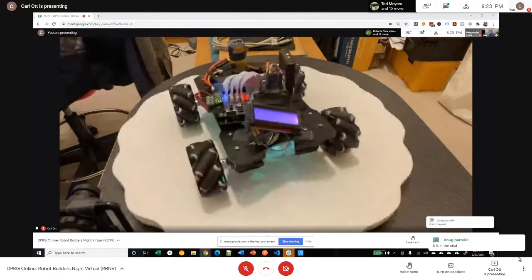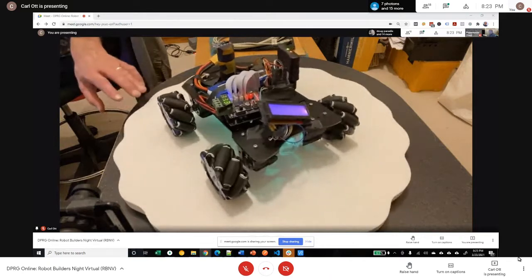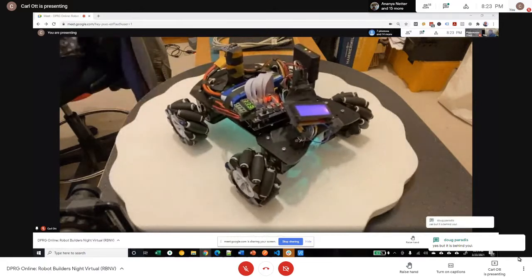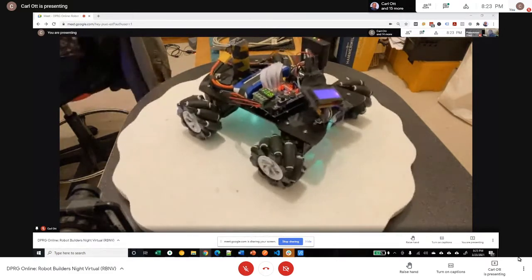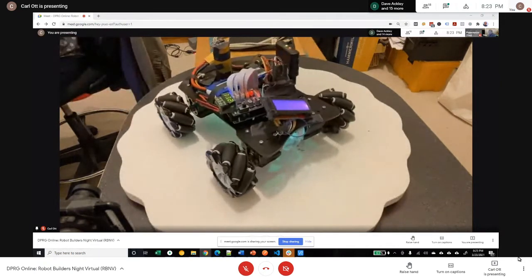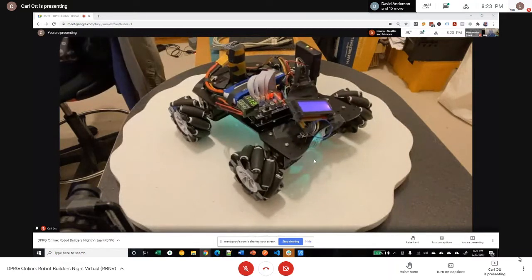Yeah, like, is there a math problem? Well, it doesn't really change anything. You still have a zero crossing, right? The circular thing. It's just a different scale. Well, I'm just saying that might tease out the problem. Yeah, what I found, one way to deal with a lot of this is to use vectors. You could use the angles like they're vectors and then add them up. That way you can do stuff like take an average by just adding the two vectors and then normalizing it. So that gets around a lot of the issues with crossing the 0-360 boundary.